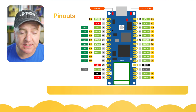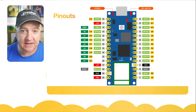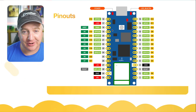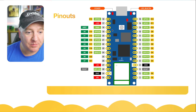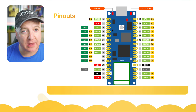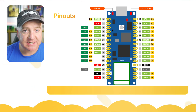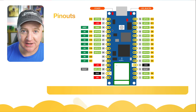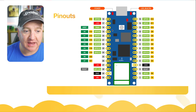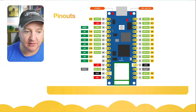Let's have a look at some of the pin outs — this is also available as a downloadable PDF from my buymeacoffee.com site, similar to the other posters I've created. There are 30 pins on this chip altogether. We can see a number of GPIOs, transmit and receive pins similar to Arduino on pins zero and one, and analog pins on the other side from pins 26 to 19, or digital pins 21 to digital 14.